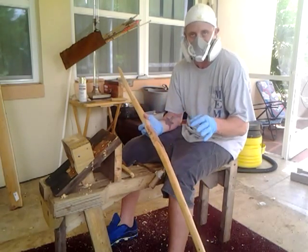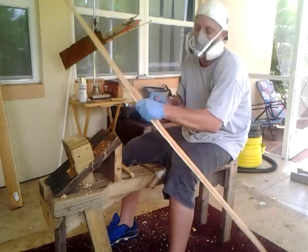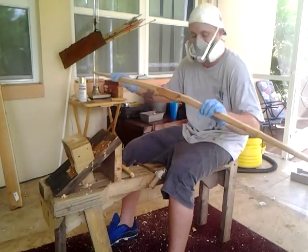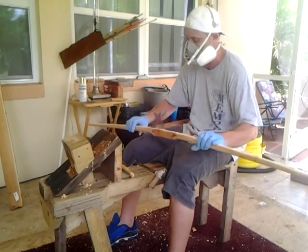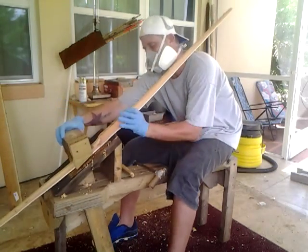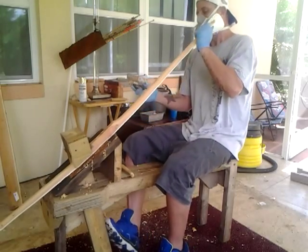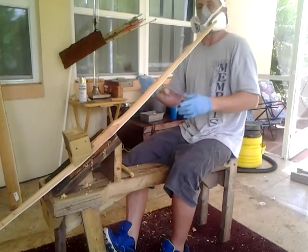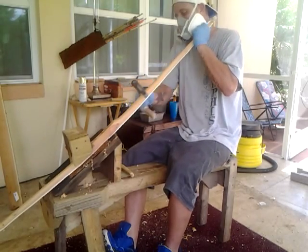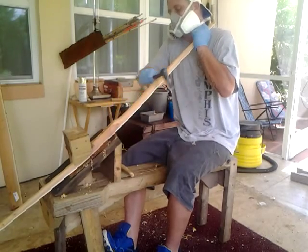Because the handle bends too. And I'm going to remove some wood from this handle to make it easier to hold. Once I do that, it's going to lose a little more weight and it's going to bend a little more even yet. So, we'll start with limb A. Put it in the dumb head. And use this just like a scraper. I'm going to remove the pencil lines.